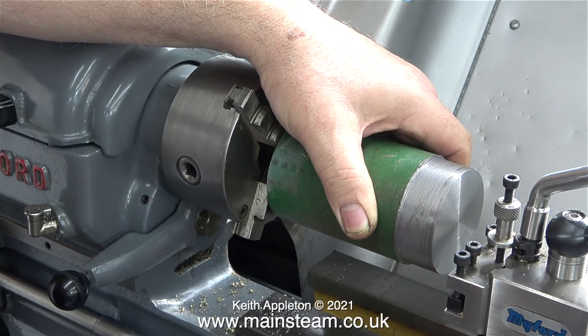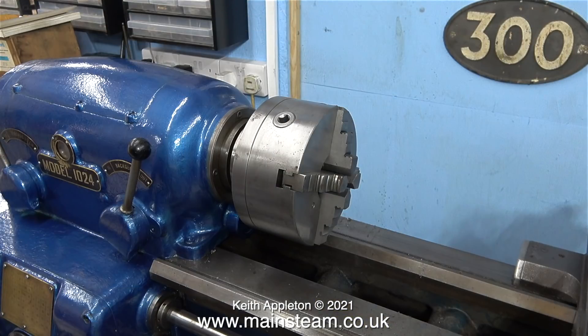You may be thinking: why do I need so many lathes? Well, I don't really — I could make do with one. I use three lathes because the Boxford has a standard three-jaw chuck, fine for round bar and hexagon. The Smart and Brown fitted with the self-centering four-jaw chuck is ideal for round bar, square bar, or even tubing — four jaws grip better than three. The Myford is brilliant for smaller stuff.